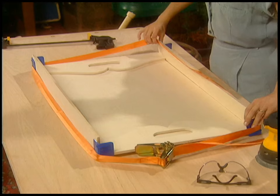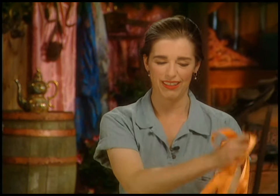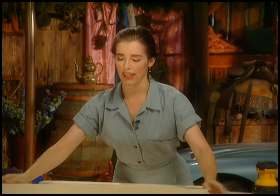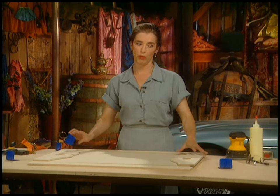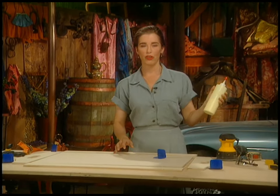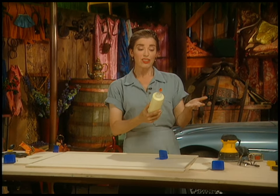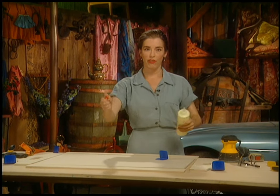Imagine what that's going to be like when there's glue all over everything — it's going to be annoying. Most yellow carpenter's glue sets up in 20 minutes, so it's hard in 20 minutes and you have to work very quickly. To account for this, set some heavy stuff on all four corners before you go further so you know the board is flat.